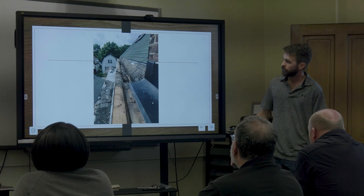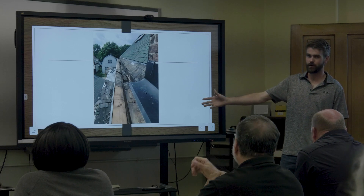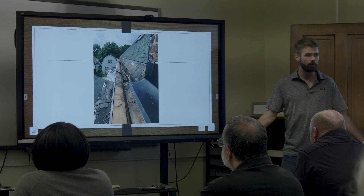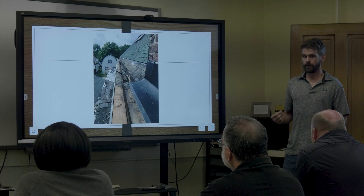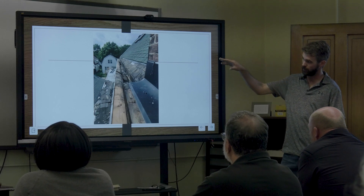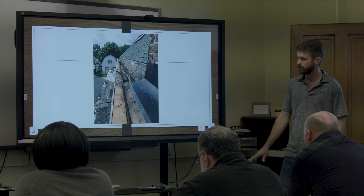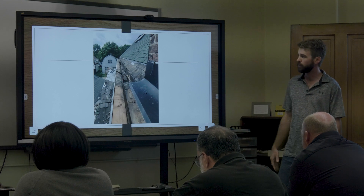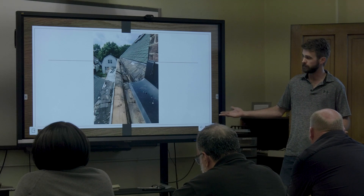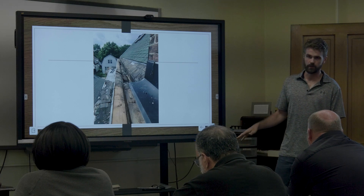After we tore it out, there's just wood repair. This is a very nice one for the most part. The trough board — the one at the very bottom, like a one-by — we just replace that. You have to pitch that right. That's the critical one where you have shims underneath the rafters, or the rafters might be notched out themselves to pitch it left or right. My company includes that with the work because it's almost a given. It's not going to be two-by-fours or major rafter work. Once you get to the crown or the fascia, you start looking at extensive wood repair.